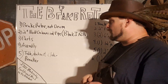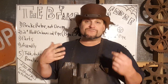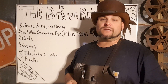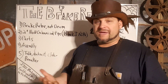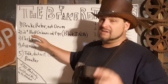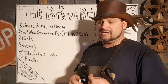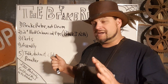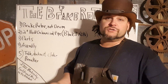You're going to want to look for a brake rotor, not a brake drum, off of a full-size pickup truck. You're going to need some two-inch non-galvanized pipe, known as black iron pipe. Any local supply stores will carry it — in the States that's going to be Lowe's or Home Depot. A two-inch piece of black iron pipe is where you want to be. Let me stress non-galvanized — galvanized is going to kill you. It's not good for you, it's not healthy. For beginners, play it safe and go with black iron pipe.